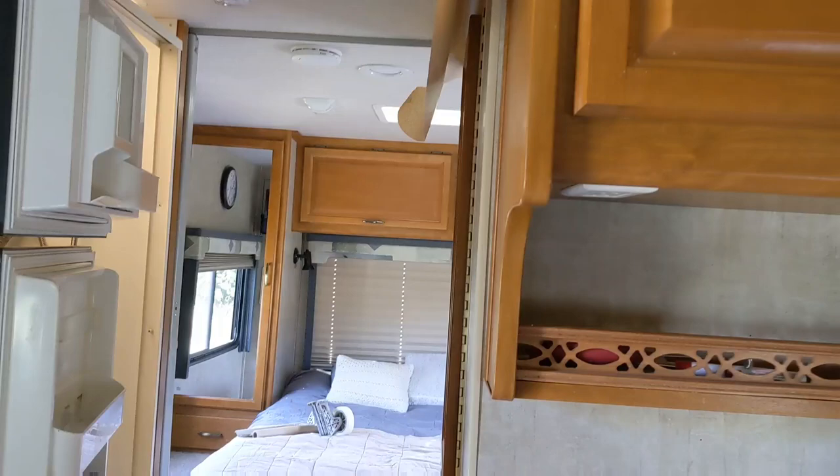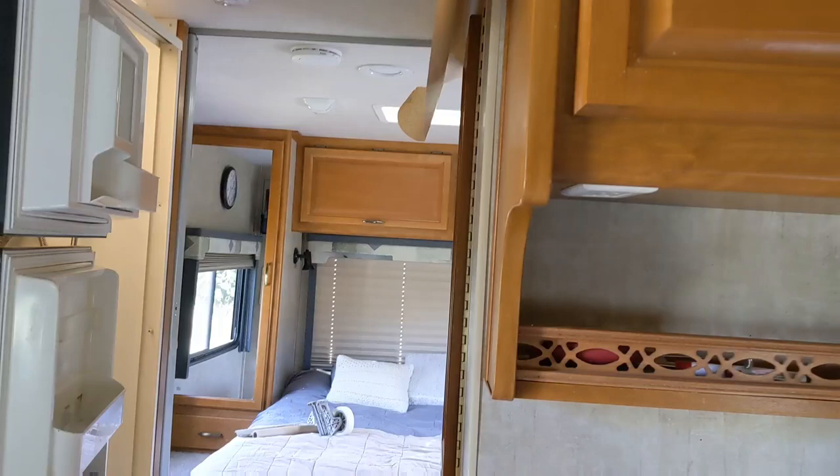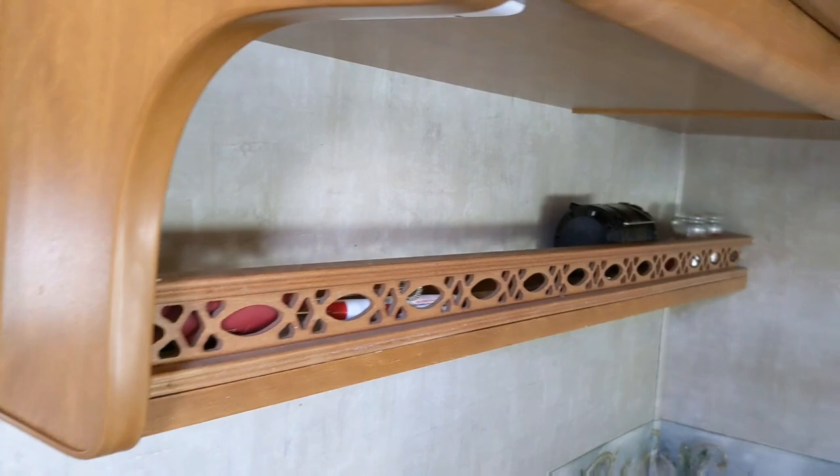There's a lot of taping off. I was thinking I could have just brushed and rolled everything with the primer, but this might be a little too much. Another thing - make sure when you take stuff off, keep all the screws taped on the door. I left the screws in where I could. All the hardware like coat hangers, I put them close by. I'll show you what to do with all the hardware and hinges - I've got a little special method that's never failed me.